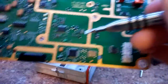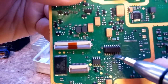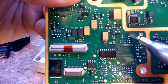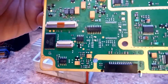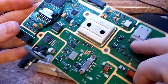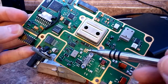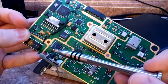Look at this — you can see all your components, very easy to get at, very easy to work on. You have some half-millimeter pitch stuff here, but anybody with a hot air station can work on this very reliably. There are full schematics available for it. It's a radio — it's very simple. Here's your power output, but that's probably the hardest thing to change if you blow it up. At the same time, you can almost throw the thing out and get another one — they're so cheap on eBay.